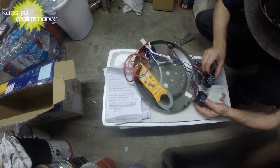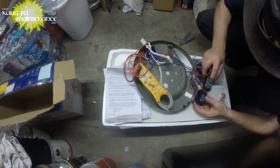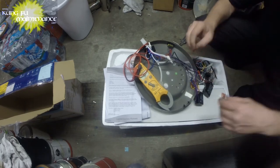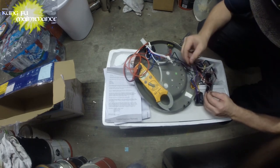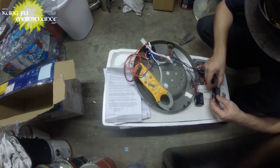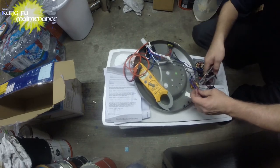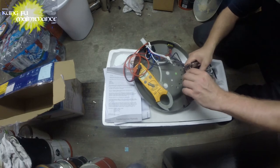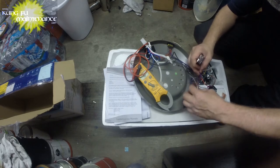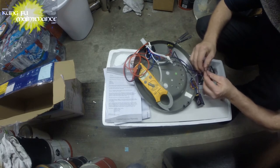So our microfarads match, they're close. 6 and 5 is reversed here. 6 and 5. But it won't matter, it'll just switch through the speeds to make it happen. Okay. So here's the purple one. And then this other purple one's already connected here on the bottom, so we can just separate there and connect it to the bottom here.